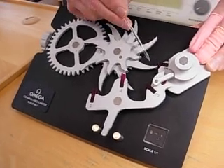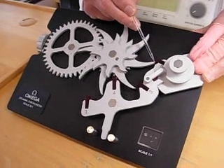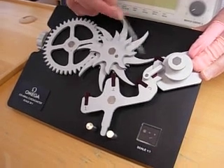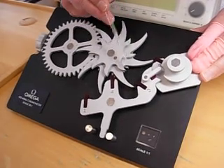The impulse is now being delivered to the balance wheel. We're going to see the tooth completing its impulse — we're just about at the point where the tooth is coming off of the impulse surface. When that happens, we'll see this tooth of the coaxial coming forward to lock on jewel number three.